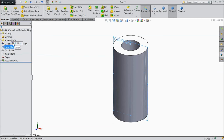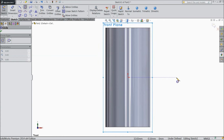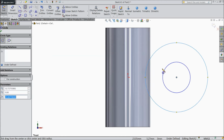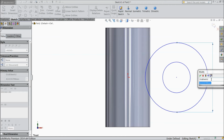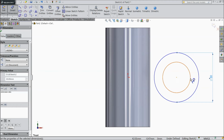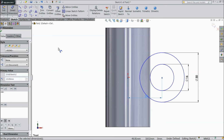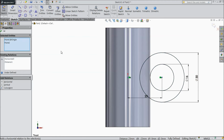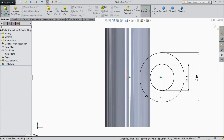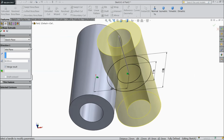Now select right plane, sketch, draw two circles, assign diameter 30 mm and 16 mm, and distance from here to origin point 23 mm. Okay, and make sure this point and origin point are in the same line, so make relation. Now select extruded boss, the same, choose mid plane 60 mm. Okay,